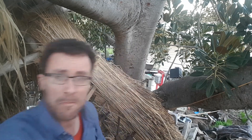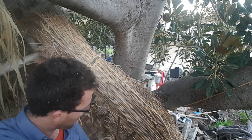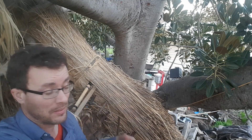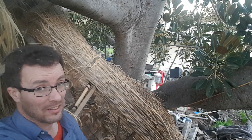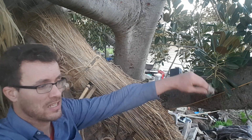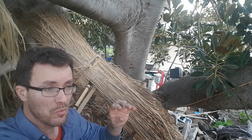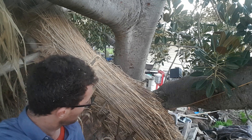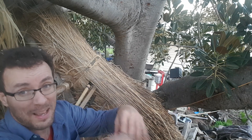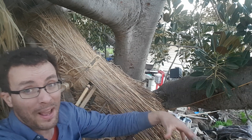I think it's going well — I've easily got a foot and a half of thatch there, so that's pretty thick. I'm starting to get it a little more even, and each course and each bundle blending in with the others a little better. But it's a lot harder to get even than it looks. I think it's going to work, and what will happen over time is the edges that are more exposed will rot a little bit faster and it should even up — although maybe not, because where there are steep bits, the bit below will get more water and rot faster.